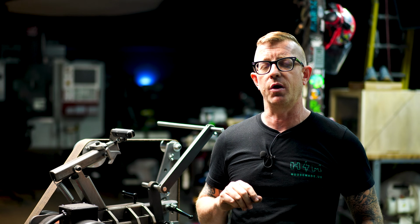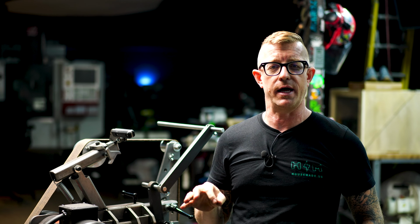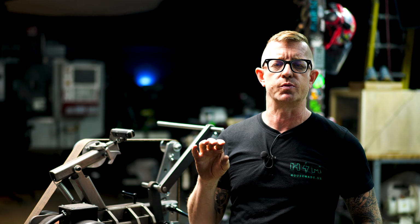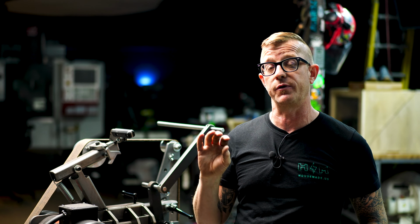One little caveat though, if your knife is say smaller than an inch from the spine to the cutting edge, you're gonna wanna run a contact wheel. We ran into a couple of small interference problems with working with small knives, and that's just something to consider. But a contact wheel does get you around that. So if you work with really small knives, just get yourself a contact wheel.